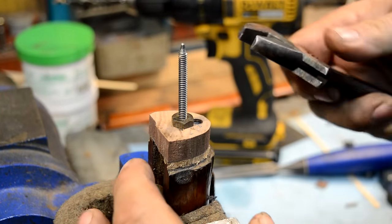When wood breaks like this or gets cut, it just doesn't sit there idly for 50 or 60 years. It absorbs water. And this end of the stock here grew, and this end of the stock grew. So this does not equal this anymore. And it probably didn't equal that before he even got it home while it was still in his duffel bag. So it's gonna move. It's not gonna be an exact fit. I don't care how good you are. Now some of this looks like impact damage here from years of having been slammed together.